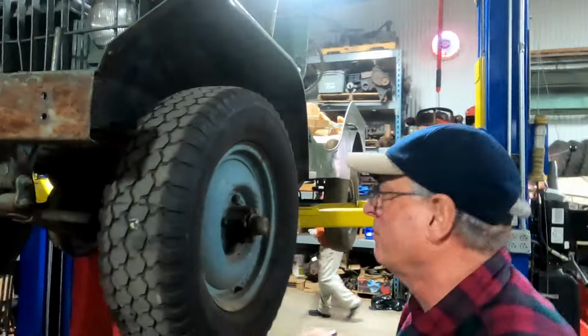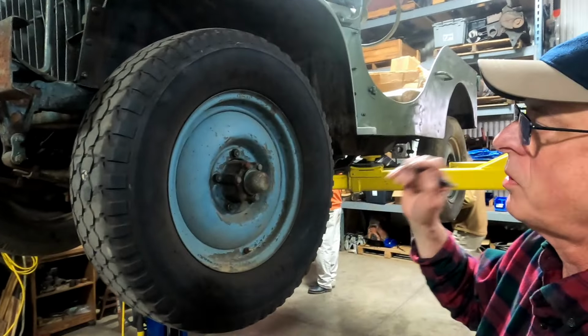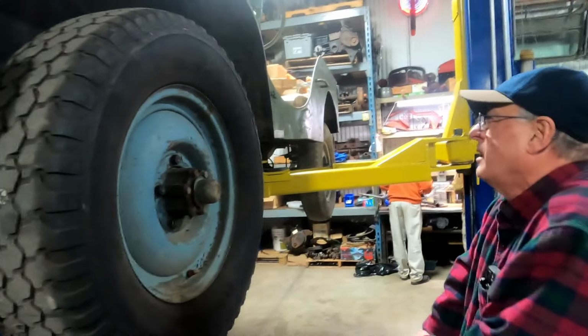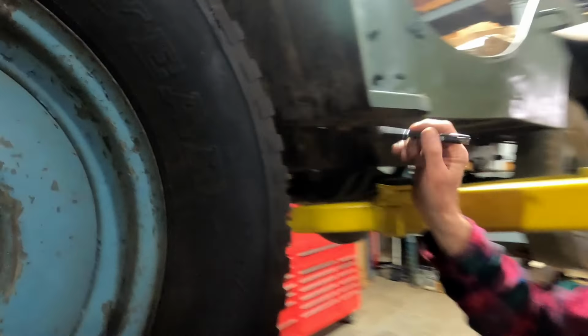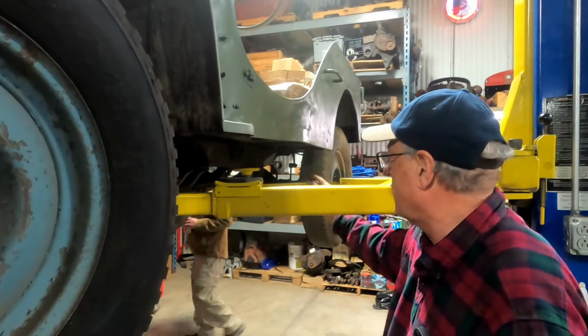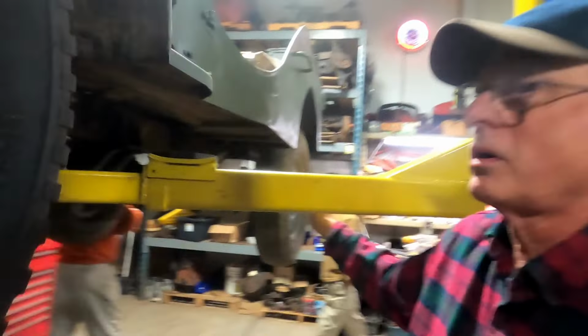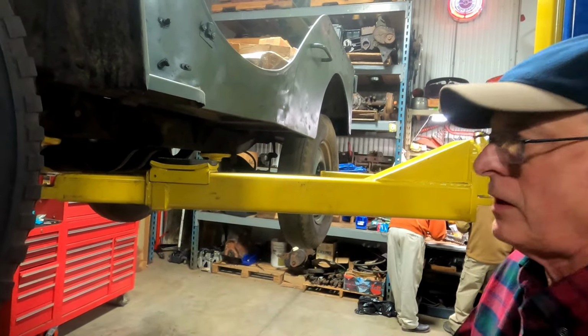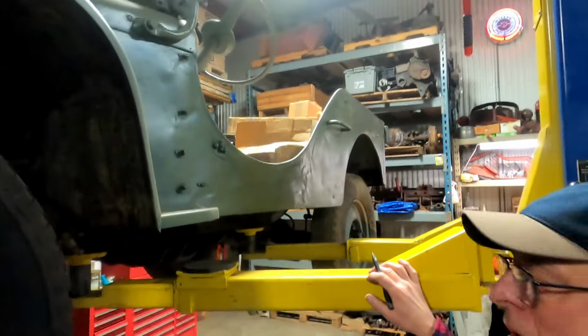The first 1,500 was Series 1, and Series 2 was 2,000 some. They used the solid disc wheels that were used on all the prototypes. They're 4 inches wide, or should be. The early CJs used a 4.5 wide. The steering column was a Ford shelf part, and I've been told it's derived from an English Anglia. They did build 50 of these in a four-wheel steer version, with a special steering box back by the frame and another tie rod that came back and drove the rear axle. It was a very interesting setup with a gear that had a delay, so you could turn the wheel and still be going straight, but after turning the wheel a bit the four-wheel steer would engage. Well, I didn't know that.